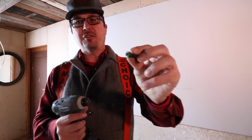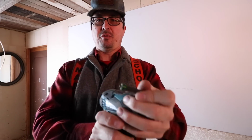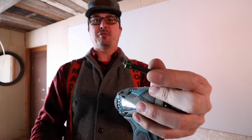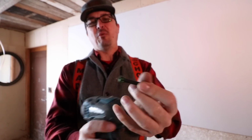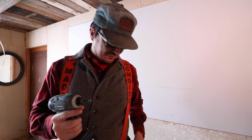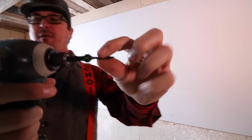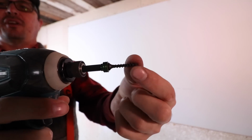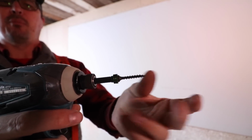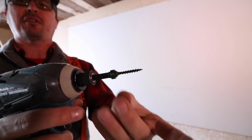I want to show you something that I just found. I didn't know these things existed. Have you ever seen these before? It's a little specific focus. It likes to focus on faces. It's a little drywall screw bit, and this was given to me by one of my subscribers. I didn't know they existed. So your drywall screw goes on there, and then when this green portion hits the wall board, it pops out. So the screws are set perfectly every time.